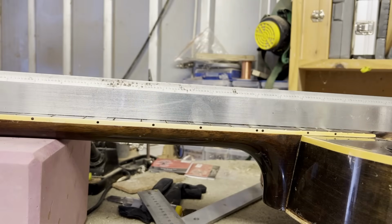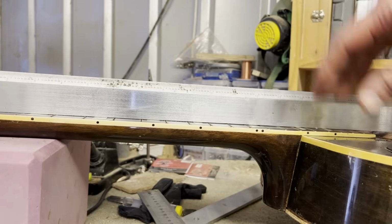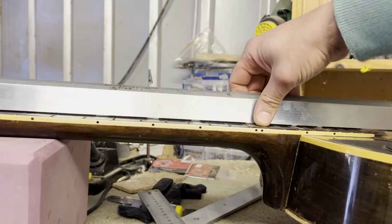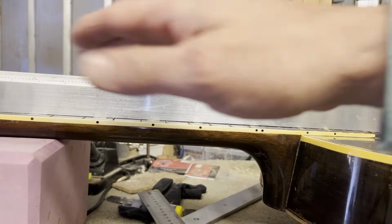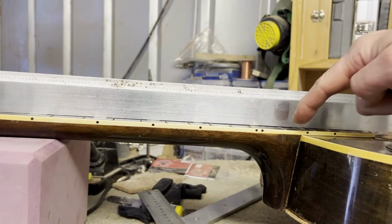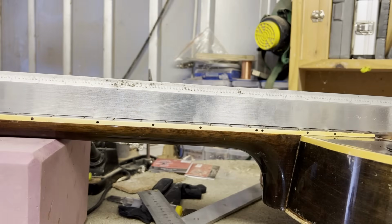What I've actually found, I found this on SGs, is if you support the neck at one end and then plane, the action of you planing actually sort of pushes the neck upwards a bit, and so naturally you plane in a fall away here anyway. Arguably it's poor technique because you're essentially planing or leveling in such a way that is unsupported, but it sort of almost does the same job as putting tension on the guitar.